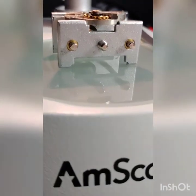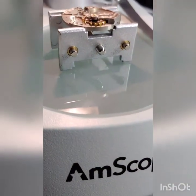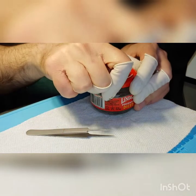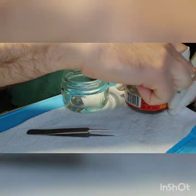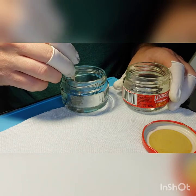We're making sure the balance is moving back and forth. With the balance mounted on the plate, I can see the impulse stone is straight and aligned with the escape wheel and pallet fork — that is very important. Once we verify that, we proceed with the rest of the cleaning. I don't have a cleaning machine so I have to do this manually using brushes and containers from the grocery store with different liquids in different stages.